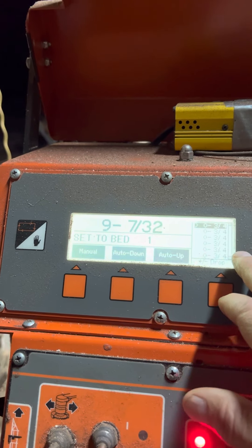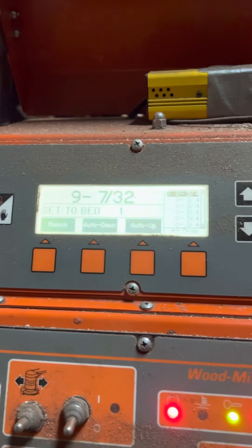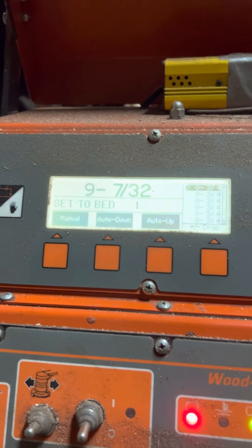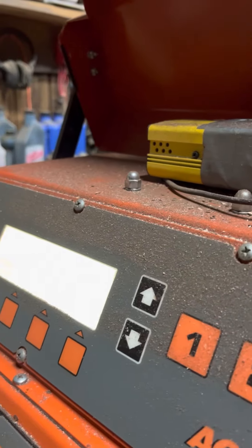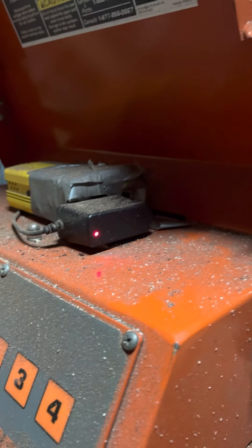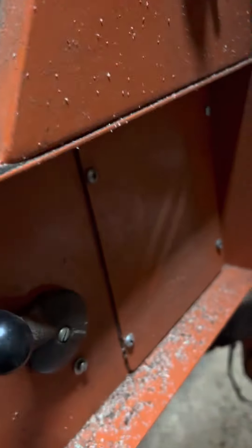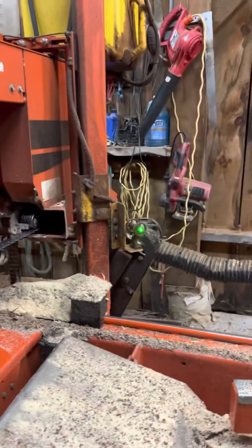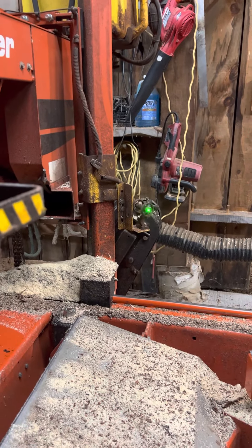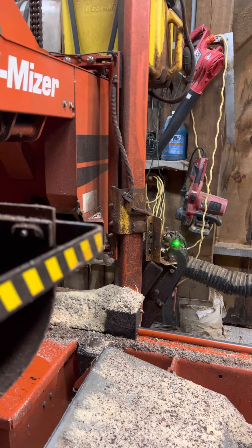Even though there are a handful of cuts, it will do three-quarters for the entire length of your log, whether it's a 20-inch log or a 10-inch log or whatever, and your last one will come out as good as your first one. On top here, this is what I put together — it's an inverter and I've got a laser from Amazon wired into the battery. The laser comes right across the front and shines on your log, telling you where you are with reference to height on your log as you're sawing.